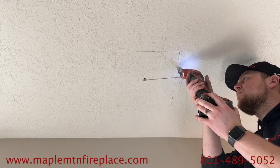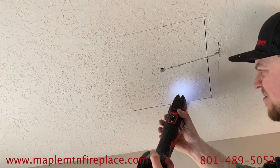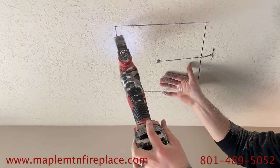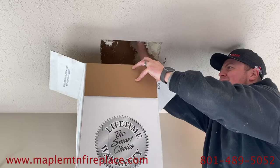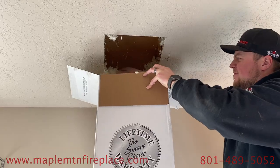So we've got a multi-tool — it cuts a nice clean hole. It's pretty easy in drywall, and because it's vibrating it's not going to cut your wires if you end up hitting one. The secret to not hitting a wire is to just barely penetrate the drywall as you cut. Alright, so we're taking out some of the insulation and we can always put that back in when we're closing it up.